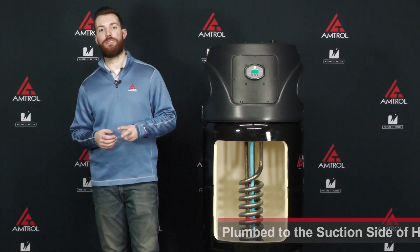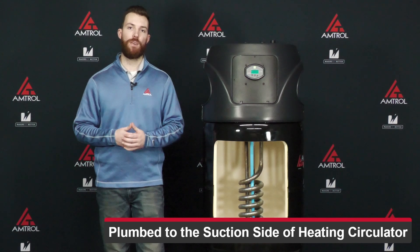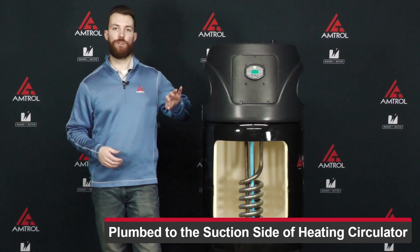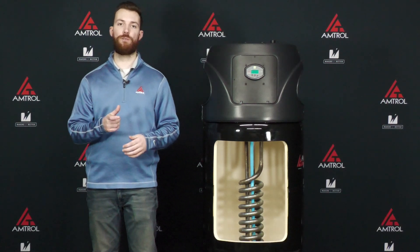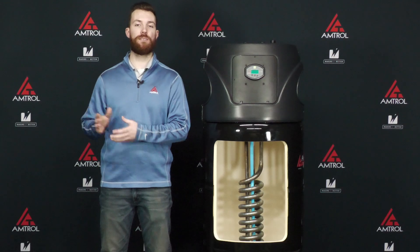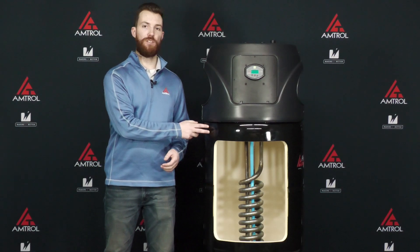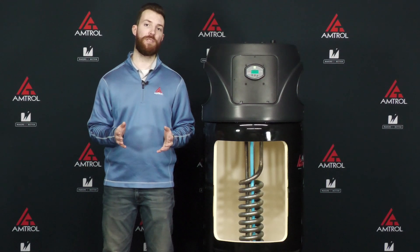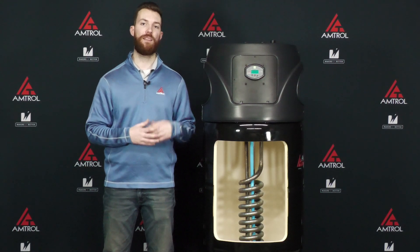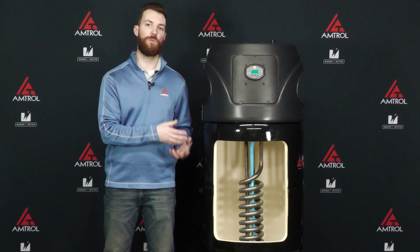The second reason could be if you plumbed your water heater to the suction side of your circulator. A good way to check that is to turn off the power to the unit, allow it to cool down, and then turn on one of the heating zones in your house. That will fire your hydronic system, and if it's pulling water through your coil, you'll start to build heat in your unit as well. Remember, the unit is off during this period, so it should not be building heat — that would be a telltale sign that you're plumbed to the suction side of the circulator and drawing hot water through your unit unintentionally.